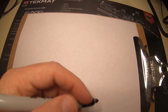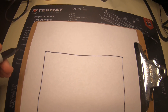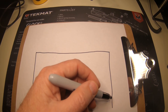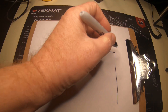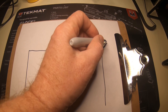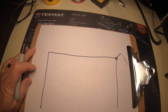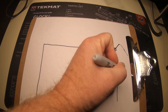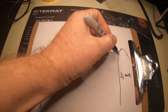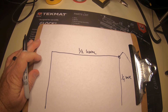Just like the name implies, the antenna is in the shape of a half square. It has a horizontal section with two vertical legs. There is a feed point into one of the two corners, and that feed point will have a coax cable that goes off away from the leg and comes down to the radio. From the feed point, one leg extends vertically for one quarter of a wavelength of the frequency it's tuned to — one quarter wave. From that same feed point, the other leg extends horizontally for about half the frequency wavelength — one half wave — then turns 90 degrees and extends another one quarter wavelength down the other side.